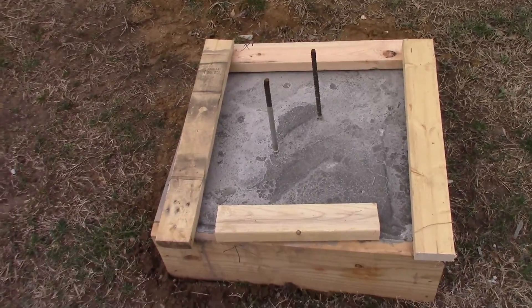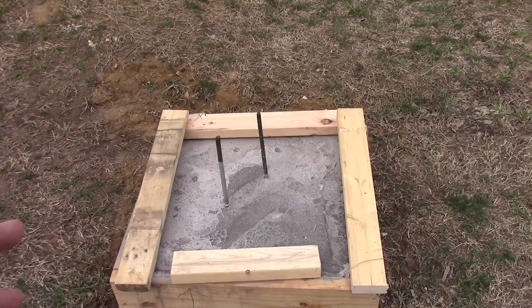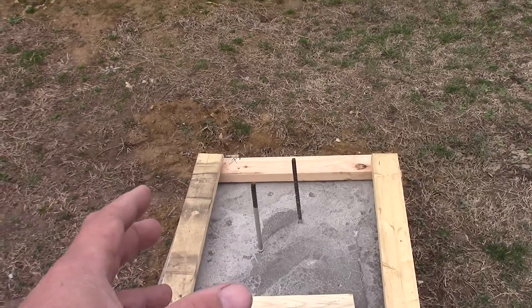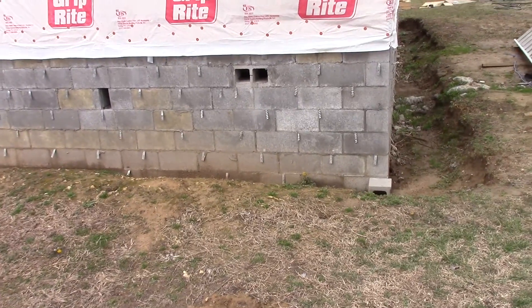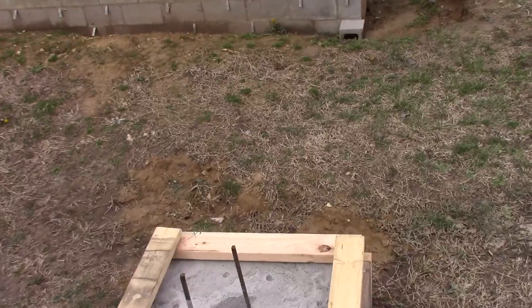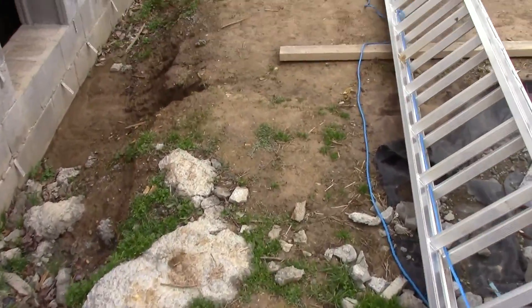With the soft ground around here, I want to have a nice big pad for it to sit on. Then we're going to have a tube coming up off of here, coming out to the height of the bottom of the beams that will go across for the deck. Most all of this will be underground once we put all the backfill in — all we'll see is those little concrete tubes coming up.